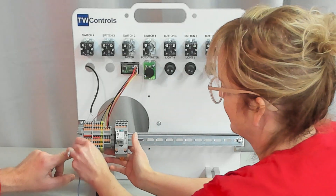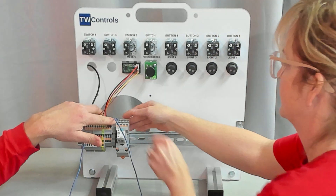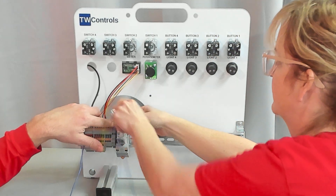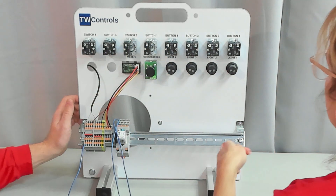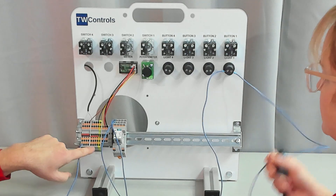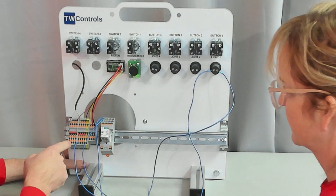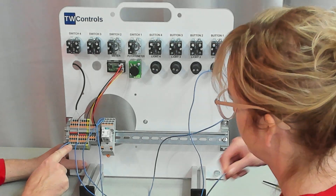Plus 24 to 41-44, to one side of our green light, then the other side of our green light to the minus of our power supply. Now take a wire from the plus 24 volt, or the left set of terminals, up to the top of button one.